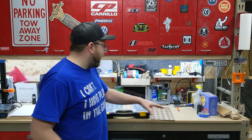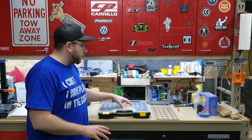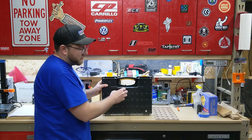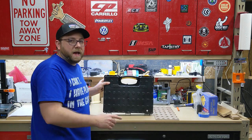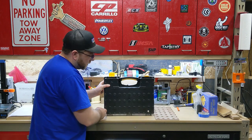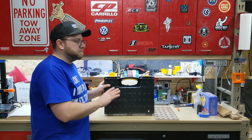Before we get started making the actual inserts, let's take a look at the Harbor Freight case itself and why this is going to work for a universal system in your tool chest and these portable boxes. These portable boxes come in a thinner variety in small and medium size, and the large size just adds extra depth. All of these cases use a recessed circle grid, which is essentially what we are replicating as inserts for the tool chests. These are in units of 39.5 millimeters by 54.5 millimeters center to center. You'll find people referring to the short side unit and the long side unit, which is a little confusing because the long side unit is actually the 39.5 and the short side is the 54.5.